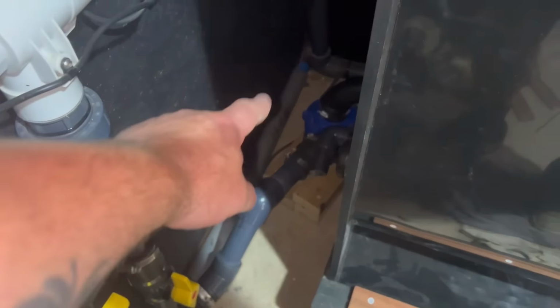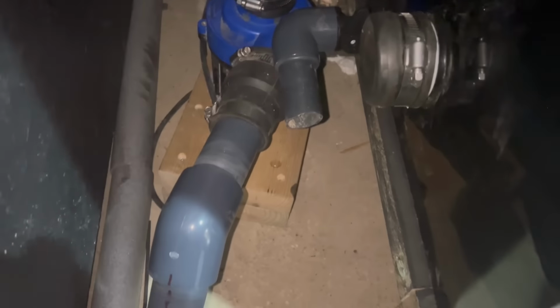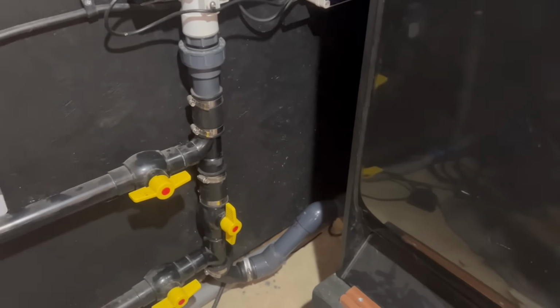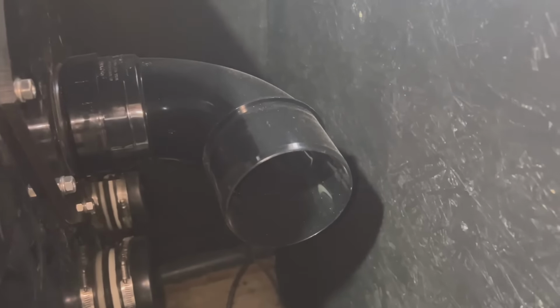All right, that ball light done. Pumps in. So cap off on one. The middle one's waste, so I'll just hook up a flexi pipe to that one. I've got to drain it, 90 into the pump, 45, 45. And annoyingly, if this was all raised up now, I could have gone a bit higher, but I'm working to existing. So now I've got to come across, all this is done. Those two are strapped up. That one's obviously plugged in, and now I just need to do the waste.